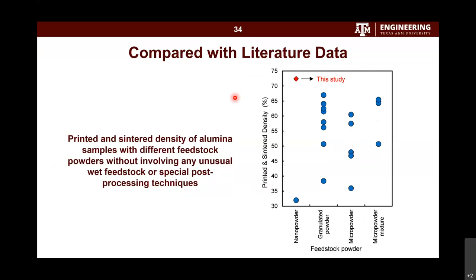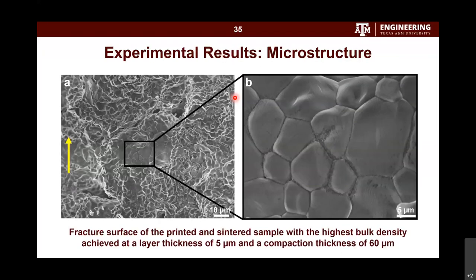Although this is a big enhancement, we believe it is still not fully dense, and we are still working on it. We are also investigating where the powder goes during aggressive compaction — why the powder cannot be fully captured into the powder bed by the roller. The microstructure now shows no very obvious large pores. In high-magnification images, we can see some fully sintered regions of very high density. This is the best pure alumina sample we have achieved.